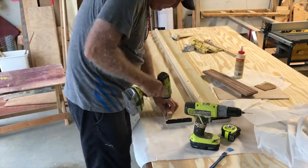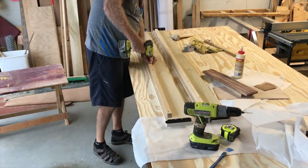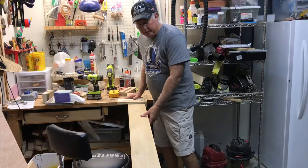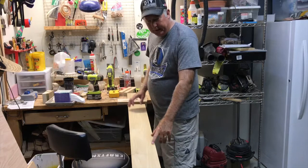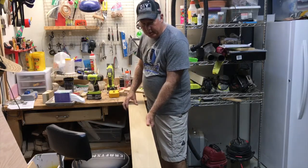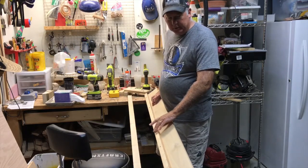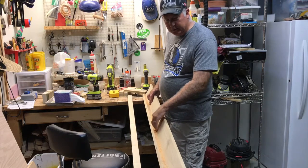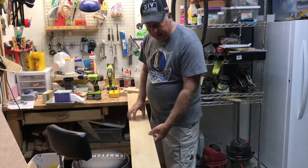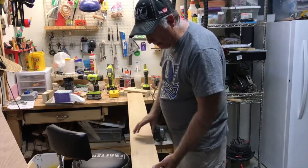I later come in and put a dowel from the front side through that for decorative and strength purposes. Alright, so I'm going to show you how I drill the dowel holes in the side rail. The purpose of this is on the side rail we have this 1 inch piece on the back that holds the slats for the bed, and so this dowel will be not only supportive but architecturally decorative.